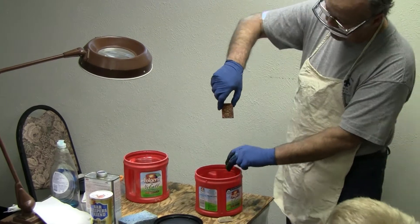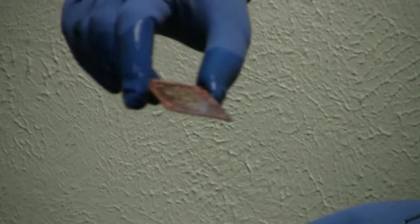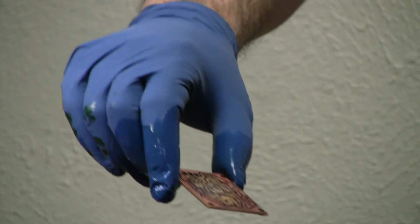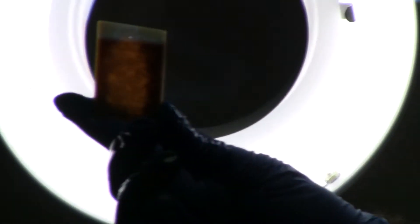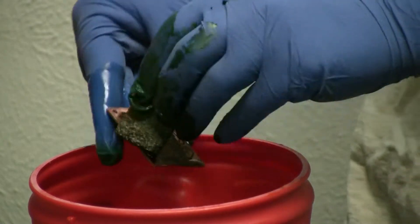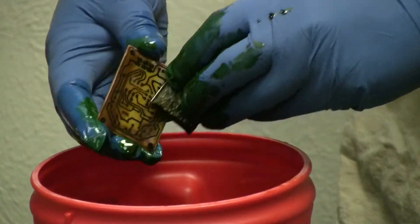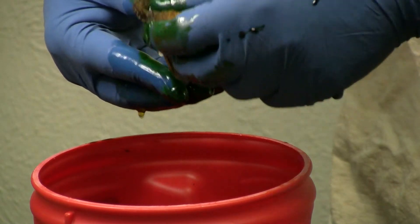Can everybody see that the center of that board — can you twist the light so that it's pointing out? See how it cleared in the center? So at this point I would just continue working. Just keep doing that — work around the edge, get it clean. You don't want to remove the toner from the board until you're absolutely sure it's done.